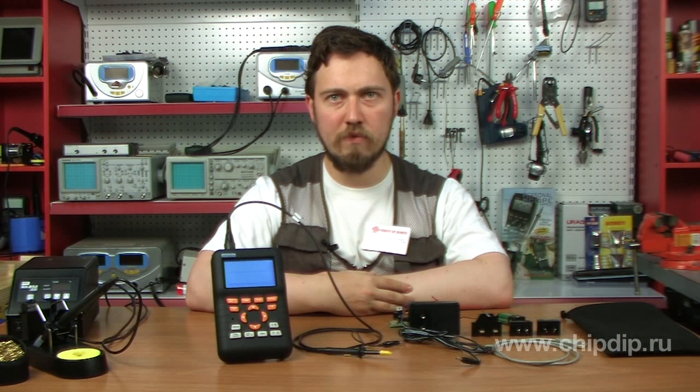Like other HPS models, the HPS50 oscilloscope features a voltmeter mode for measuring audio signals, a frequency measurements mode using markers, automatic setting of the input signal, and a display and recorder mode.